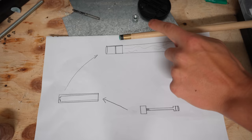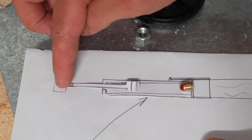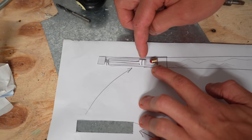I've drawn this sketch of how I imagine these rounds working. I'll have my pool stick, which has a metal cap on the end with a metal sleeve. Inside that sleeve will sit a hollow rod, and inside that rod is a piston. When I hit the pool ball, that rod will move back inside the sleeve, hitting the metal cap, setting off the blank round, which will fire the piston out at high speed, hitting the pool ball. But I really have no idea if this will work, and a lot can go wrong here - like the whole thing exploding, or the piston shooting out like a bullet, or worst of all, I don't actually get enough force to set off the blank round.